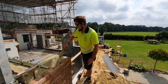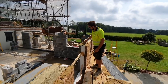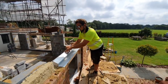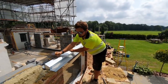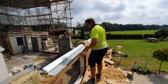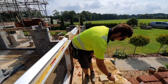On with the lintels and upwards. Put a bit of mortar on so it sticks. It's as easy as that! Brickie's favourite — close enough, it's in the lines. So you've got another course to go — soldiers on top of these windows, which is just bricks laid on their ends at 90 degrees. Three courses in between, a little block on the inside, then plate height, and then this bit is done.